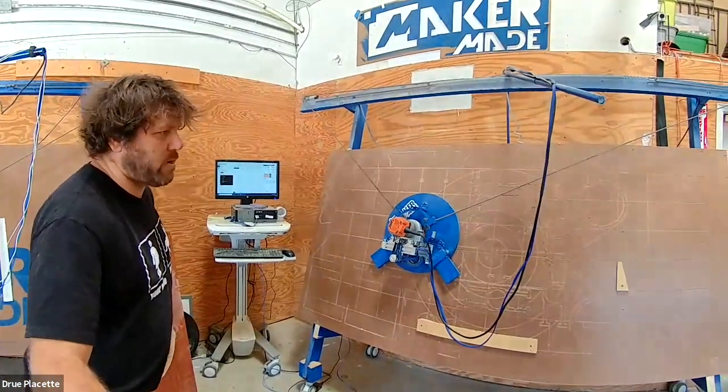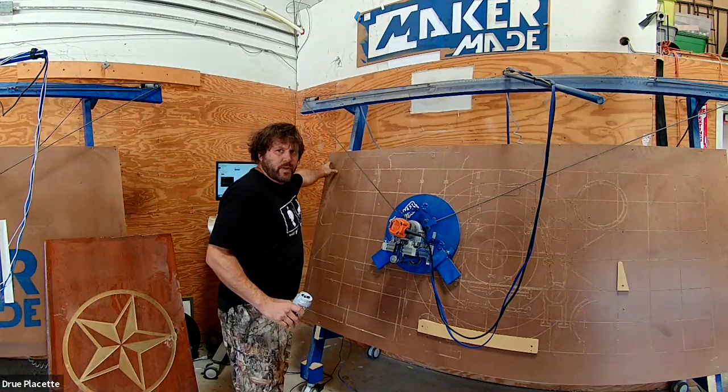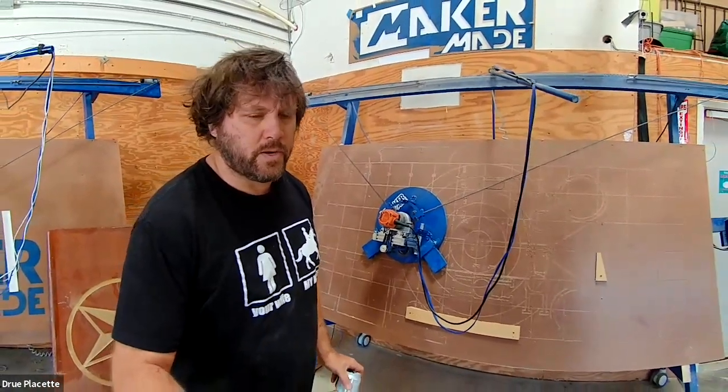So really, if I have like a 4x4 piece of cut material, I can put that anywhere on my wasteboard and then just jog the machine over to the position where it needs to start. Yeah. The only thing you will get sometimes is soft limit alerts. Let's say you put it all the way up in the top corner, and the sled needs to go up to that very top corner. Depending on how your calibration is, you're going to hit some soft limits, where it's going to pop up and say, hey, you're outside the bounds of your workspace, even when you still have room to move.